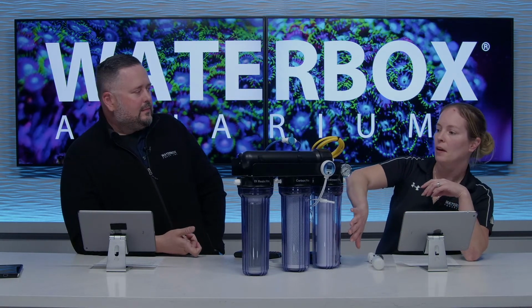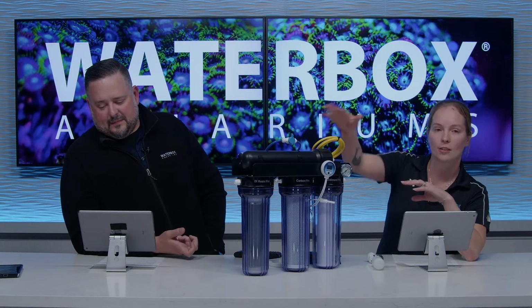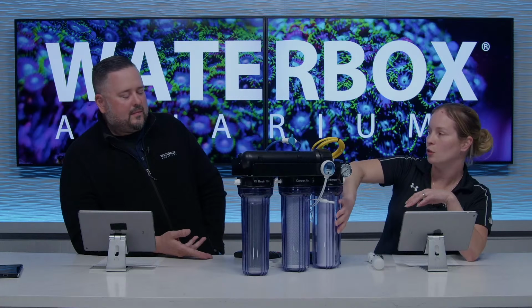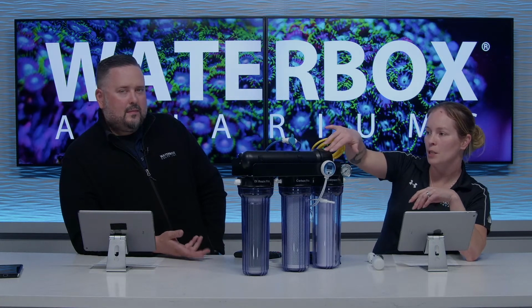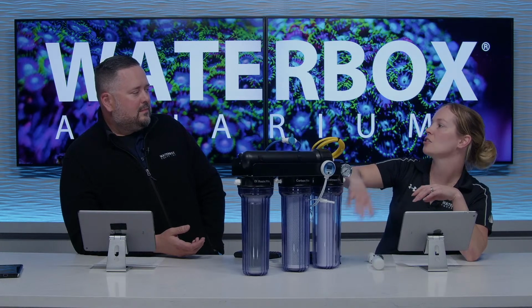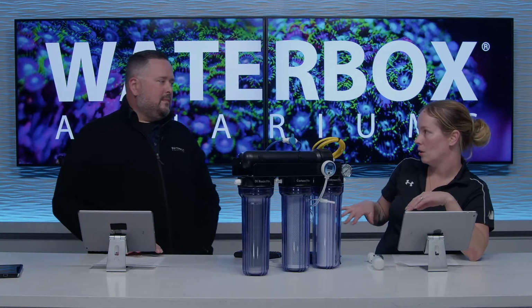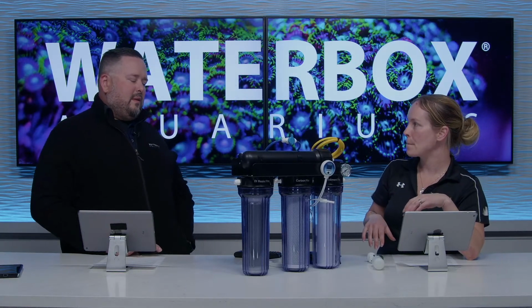Because these are your gatekeepers to the membrane and everything else, and the membrane's much more expensive to replace than your pre-filters. The membrane usually is going to last you a year or 2 if you're keeping these changed and using your flush kit. The membrane does not get changed often at all, which is great. What's the telltale for that to be replaced?